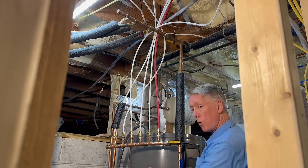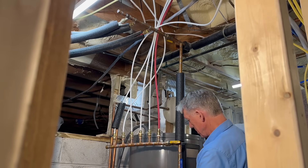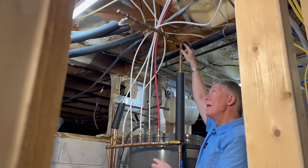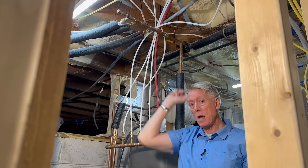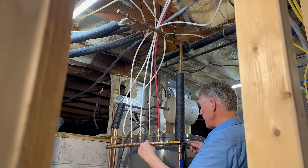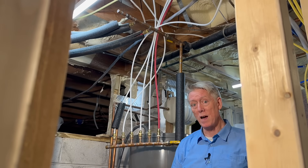The new manifold for the basement has this amount of hot water to get to the manifold. The old manifold has that amount plus additional water to the manifold, and then the manifold itself is longer. So to get water to the kitchen and our bathroom upstairs takes longer than it would if I had put that manifold down lower. If I had, we would get hot water faster too.